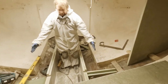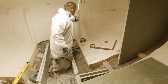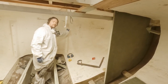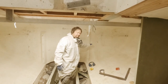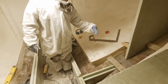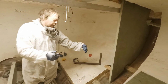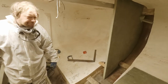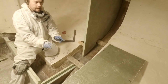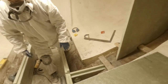We want a full-size sheet right here, then the smaller panel on each side, and then we'll have bracing more or less in line with this. It'll line up with these because that's for the bin boards. So there'll be a brace right in here that will incorporate the bracket for the bin boards. It's actually just all going to be glassed in. Basically, we'll take some layers of foam and build it up with a gap in the middle, and that way the bin boards can slide into it. So we kill two birds with one stone.